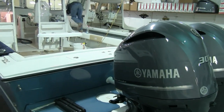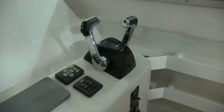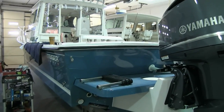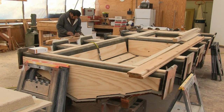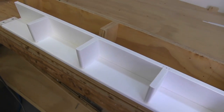After that, it goes to the mechanics shop where we mount the motors, the pumps, all the house side, the motor side, the batteries, the switches, and then the electronics — and then that's the completed stage. We use all Yamaha motors and all original equipment. We manufacture all our own molds here — we make the plugs, we make the molds, we do the designs. We have a CNC machine, and we make all our own drawers, rod holders, and sinker trays.